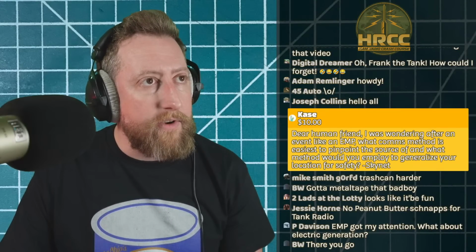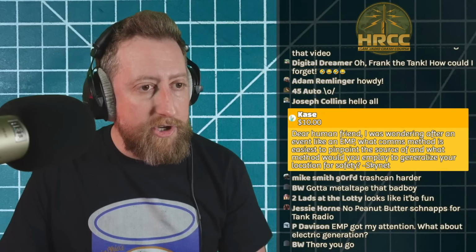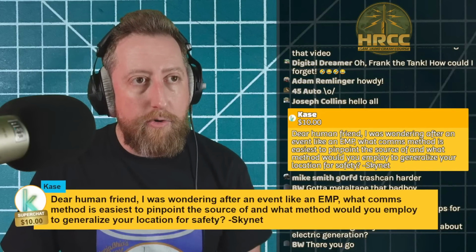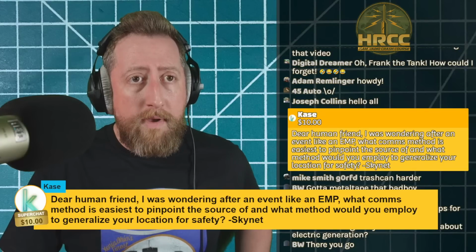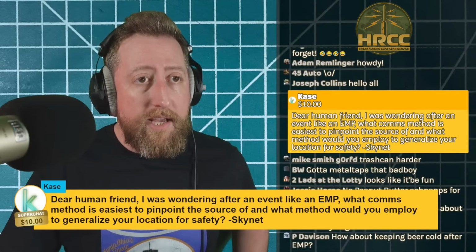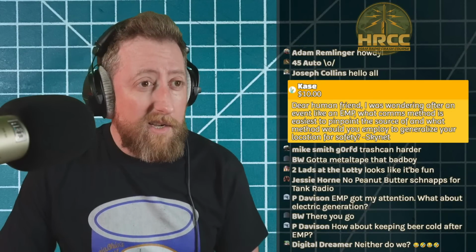I don't know that I understand the question. I appreciate the super chat. Thank you so much for doing that, but I don't understand what you mean by generalize your location. If you're transmitting at all, you are going to potentially be seen by whomever, right? If you're transmitting, you're putting out your location. Regardless of the people being able to understand what it is you're talking about or not, even if you were encrypted, your signal is going out there in the form of RF, and anybody can see that signal generally against their radio, and they'd be able to find you with that. So you kind of can't.